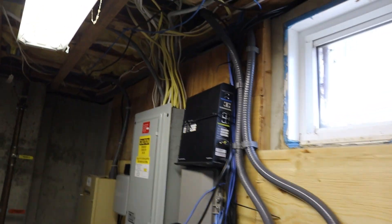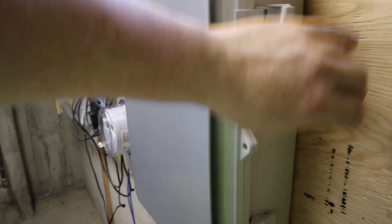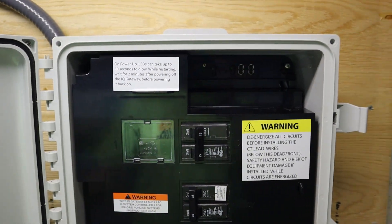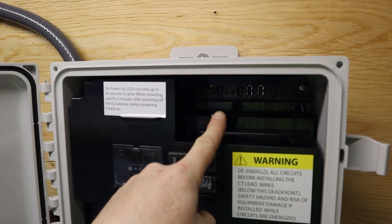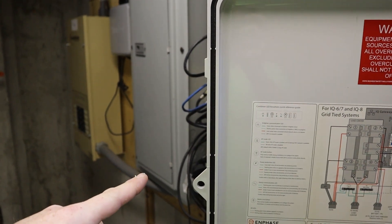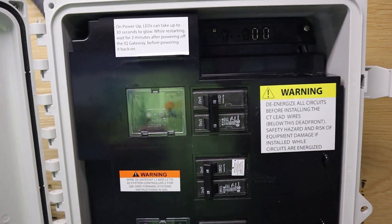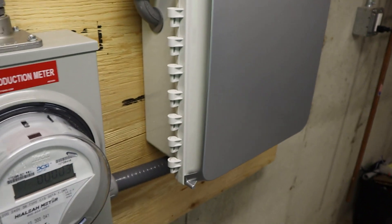Now we're down by the electrical equipment area. That's where our conduit comes down from the roof throughout that LB, and it comes down into this box here from Enphase. This is a combiner and meter enclosure — those are flashing red just because I just shut it down so now it's booting back up. This actually combines the solar power and has a built-in metering device inside there. It keeps track of how much power the system is making as well as how much power the building is using, so the customer has an online monitoring system telling them how much power came from solar versus the grid.